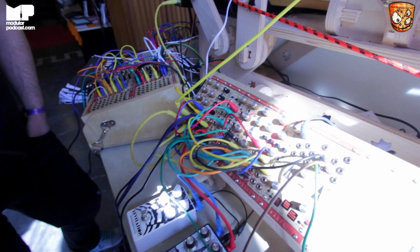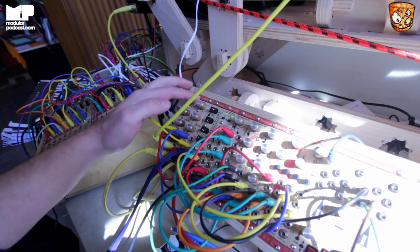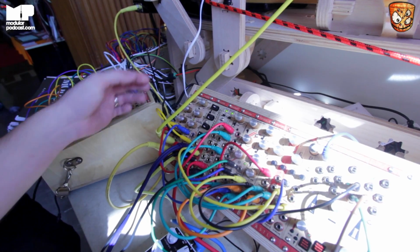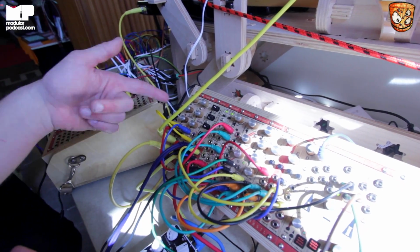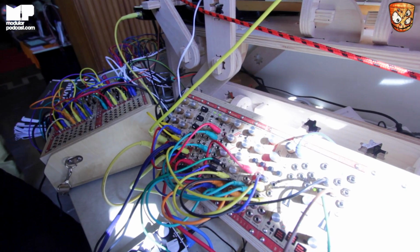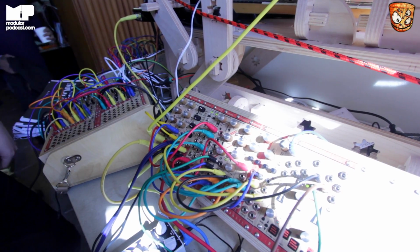So this is basically the trick of the module. Because the CV controlled crossfader between dry and wet is VCAs. If I would want to make a tremolo effect on the guitar, I would use the same CV because it's amplifying the input signal. Yeah, also. Yeah, don't use a wet signal, but just... Yeah, so you can just use it as a VCA for the inputting signal. Yeah, brilliant.